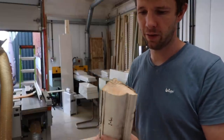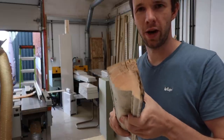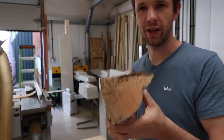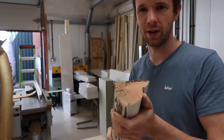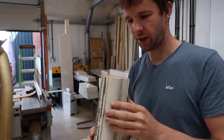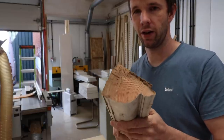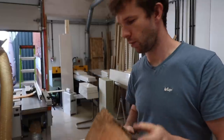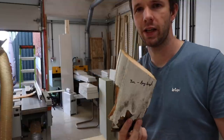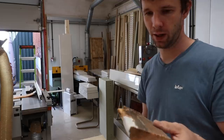So I think I've got a selection of cutters that will get it near enough and we'll get away with it. It's on a first floor anyway, so it's not going to be absolutely exact, and I think he's replacing everything that's there, so it's not even got to marry into another piece. So we'll get away with just matching it with cutters we've got, rather than spending a load of money on a specific cutter to cut this one mould in. But like I say, I'm going to start with this piece because I've got this timber, and we can run them out nice and quickly.